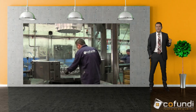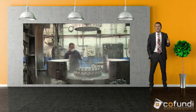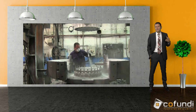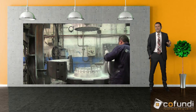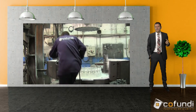Right now the employee is cleaning the already preheated mold so that the paint adheres to it. As you can see, the paint is white and it serves for protecting the steel against the aluminum, because the hot aluminum can chemically attack the mold. The color also conserves the heat, so it is a paint specifically for protection and maintaining the heat.